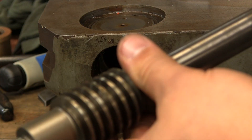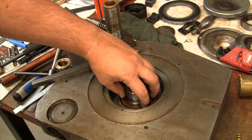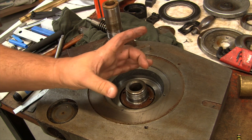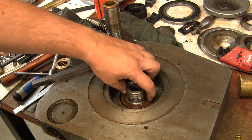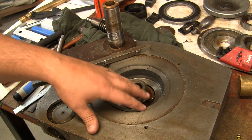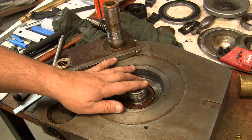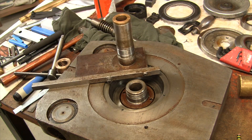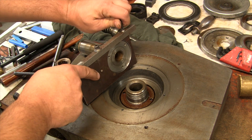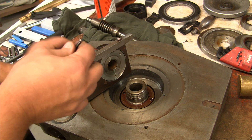The craftsmanship on this thing is just through the roof. So the next thing we're going to have to do is make another tool — a cupped spanner wrench. I have to actually order the metal, get some thick tubing, put it on there, put some hardened pins in there to free this last lock nut because I can't get it out. Once I do get it out, I can take the table off and de-rust everything. The other parts are going to go into purple power — start degreasing everything, getting everything nice. This tool came out fine for what it is — it's a total quick and dirty crude tool.